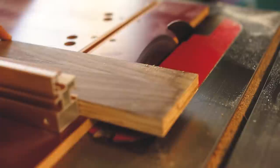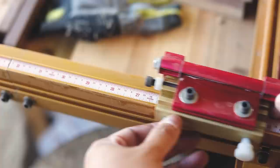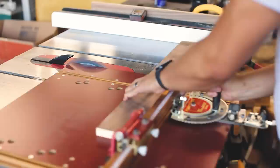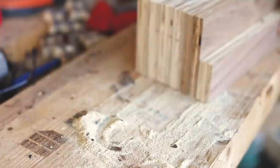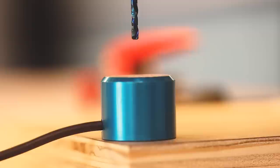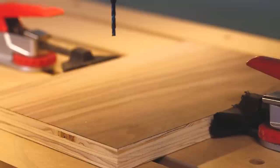Once I got all the widths cut out, I went ahead and cross-cut them to the appropriate length using my crosscut sled, cutting these down to about 27 inches. The link in the description below will have all the dimensions for you. These are all the pieces you need for the rails. I'm going to make the knobs on my CNC. You may not be able to do this yourself if you don't have a CNC, but you can always purchase the plastic knobs available on Amazon. You need six for this jig, but that depends on how wide you make it.